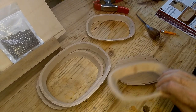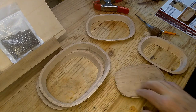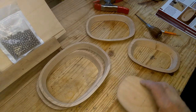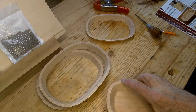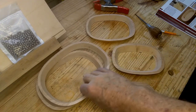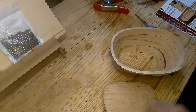Same scenario — put this ring on there, centered it through my outer line. I'm going to cut that line at 35 degrees, just like we did on the other ring, to make it fit. That should make it all line up and give us the curvature at the bottom of the bowl. I'll cut that quickly, then we'll start dry fitting these rings and see what we need to sand to make them fit together with no gaps.